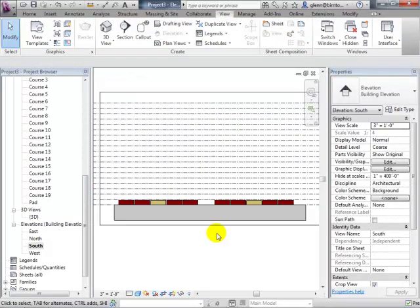Once you have a view and some bricks in the view and you want to start stacking up, in the same way that we did the arraying to stack them out to the left, I can take this row and array it up and over, or array it straight up, depending on what you want. If you want a stack pattern, I'll just array up, and I can make 18 of them, a whole wall that has a stack bond going all the way up. If I want more of a running bond, I'll go up and over to create the run. Then I can do one and copy those two to make a second and third and array it up, or do them all and go back and fix. There are any number of ways to do it, because you're pretty much stacking blocks at that point. But let's show you those variations.